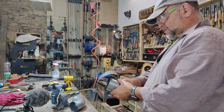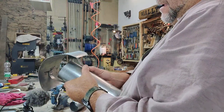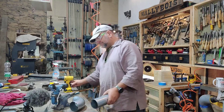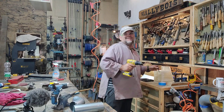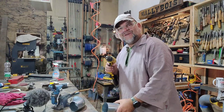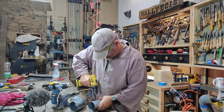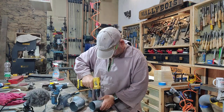So what we'll do now is drill a hole on the sides of the tube — one to start with, and then we'll do the other side. Ideally you want to use a centre punch like one of those to create a little dimple to drill into. I'm going to try and do it freehand. Probably a silly idea — probably going to cause trouble drilling without a punch. And it did give trouble.